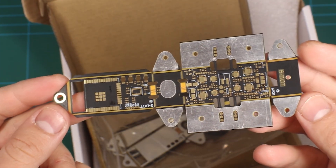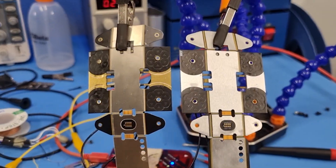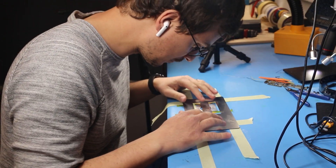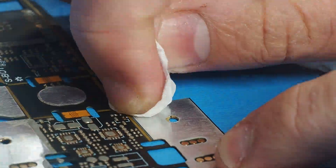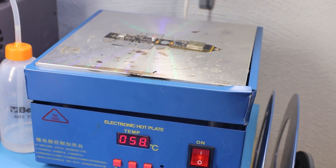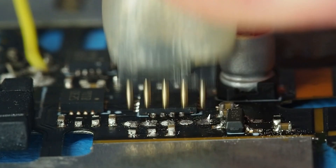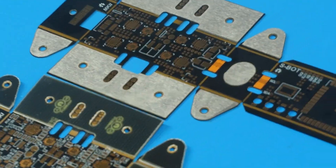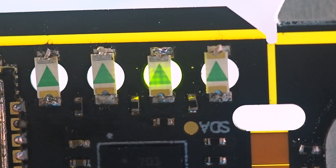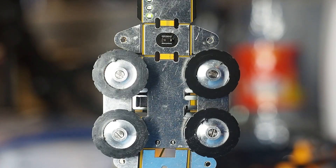Thank you to PCBWay for being an awesome sponsor and remanufacturing my design. With this new version I replaced both the steel and FR4 stiffeners with aluminum, which also acts as a heatsink for the motors. I fixed the stencil issue — it was still a bit annoying to squeegee the solder paste but at least I didn't have to cut it. Each motor driver now has a unique set of programming pins. I also upgraded the two bulk electrolytic capacitors to 33 microfarads and re-routed the LEDs. Debugging was now straightforward.